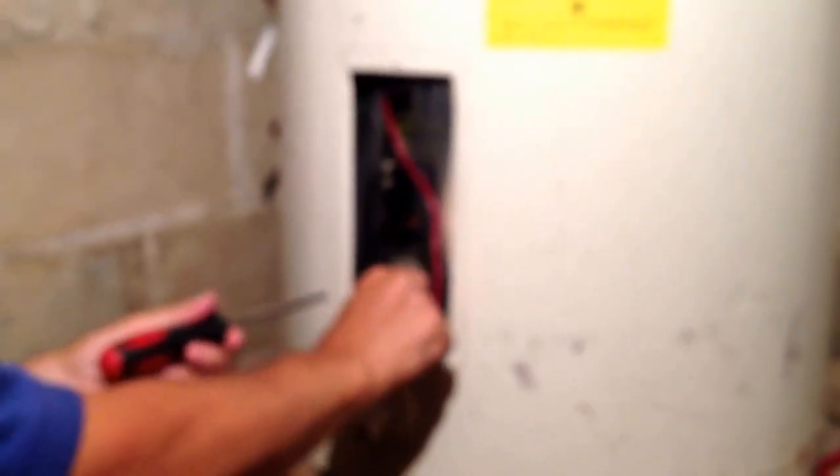This is a very easy job to do and it's a lot cheaper than paying a plumber to come out. You'll want to take your multimeter and set it to ohms — on this one you'll want to put it on 200 on the ohms setting. You should have a reading between 10 and 15 ohms.